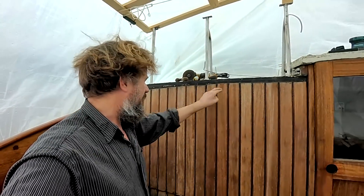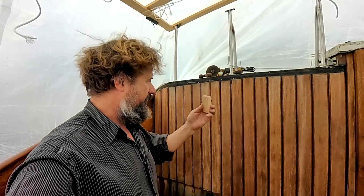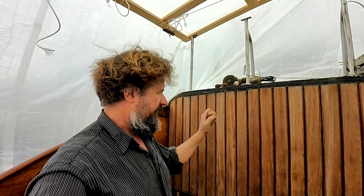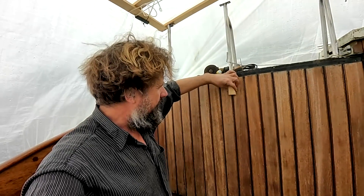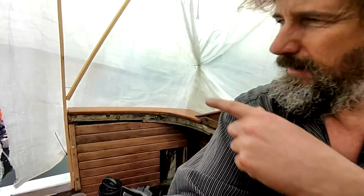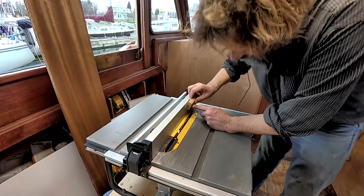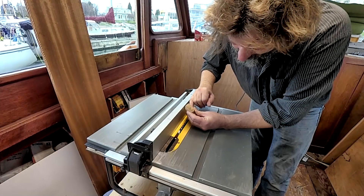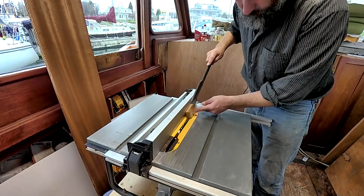The horizontal line is pretty easy to draw. For the vertical lines I have to measure from the gap each time. So I'm making this little block — it's sort of a proof of concept. I'm going to use the table saw to make a little notch, a little slot in it, so that I can slide it down in the v-groove and use that to mark off consistently where I'm going to drill. I have a lot of this material to do — all the back and the two benches. It's really pusher-stick work, a little too close for the fingers.